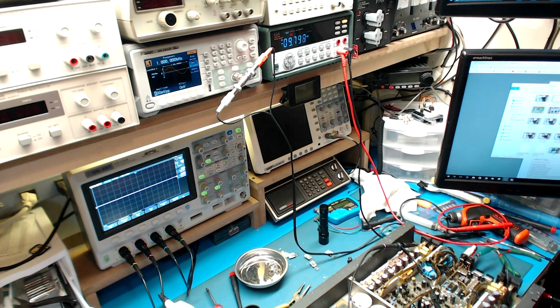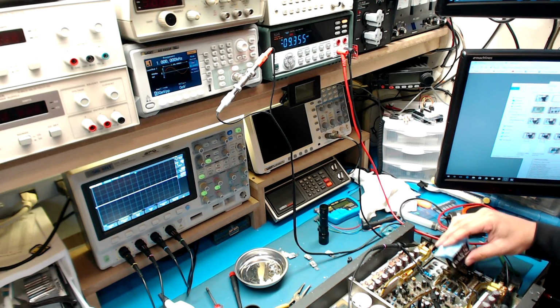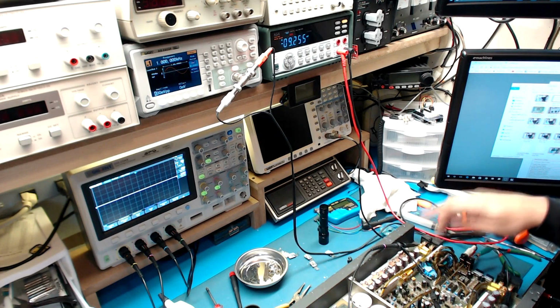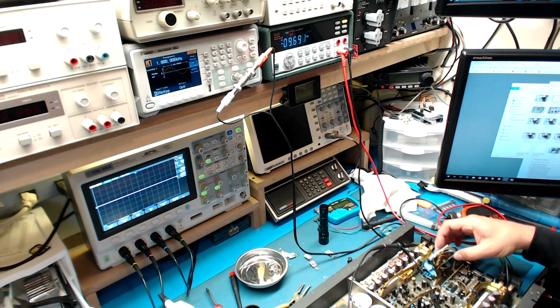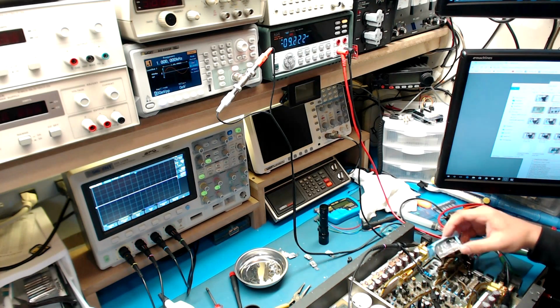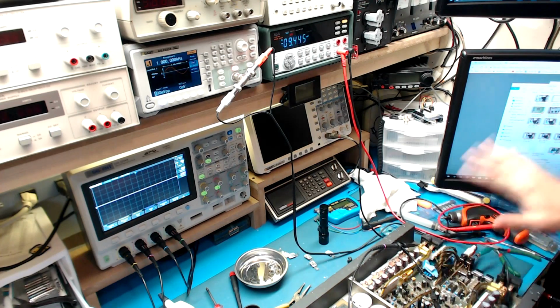I want to mention one little tip on these amplifiers. When you're working on them, take the EQ adjustment board out of the amplifier, tape it up, and plug them in on top. Never run the amplifier section without those pots hooked up. You will open loop tons of op-amp circuits and cause these amplifiers to run wild and blow things up. So never run these amplifiers with the EQ adjustment potentiometers disconnected. That's the tip of the day right there. Something small like that will ruin your day and start blowing stuff up in sections that had no problems.